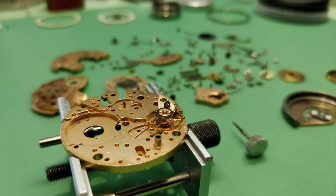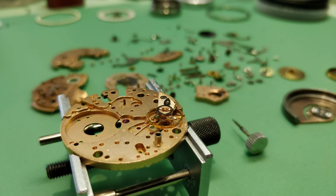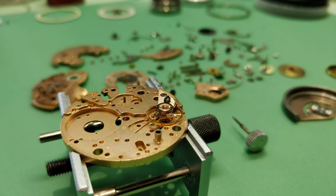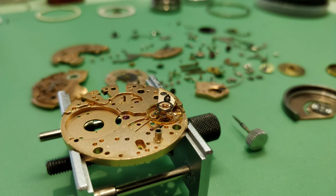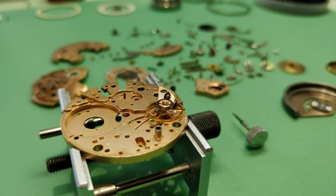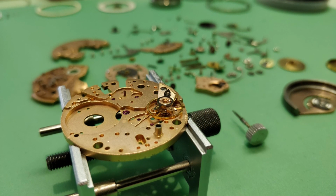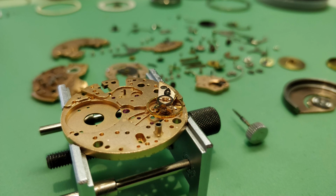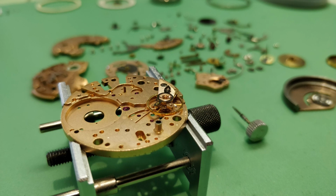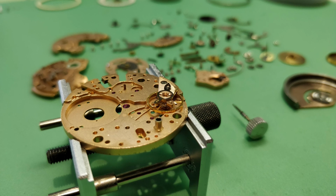But this video is very different, because it's less of a discussion and instead is directed towards those interested in seeing the full disassembly of my Speedmaster Mark III. With this movement you see quite an interesting mix of things, because at base it's an 861 caliber, the same architecture as a modern Speedmaster, and very similar to the 321 of old from the 1950s and 60s, which has gained such fame. Except this watch has central minutes, a higher beat rate of 4 Hz, and of course automatic winding. I hope you enjoy this video and the insight it gives into this very different world of watch servicing.